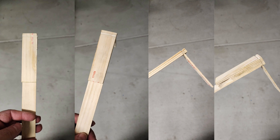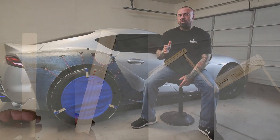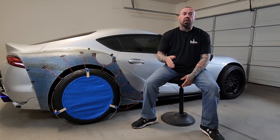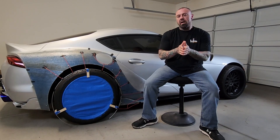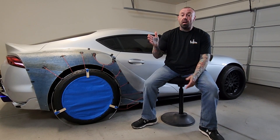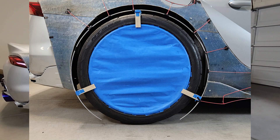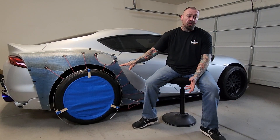If you know what you want your dimension to be, you can laminate them together like I have and create whatever height you want. On the bottom, knowing that I wanted my wheel arch to sit basically flush with my tire, I was able to square off the bottom on the back side of my round rod, and that simulated butting up against my tire. Now I have my flush fitment and the spacing that I want, holding my wheel arch in place semi-permanently while I do my template round rod.